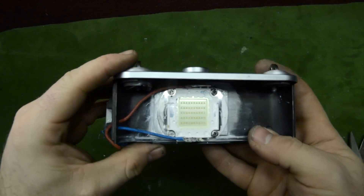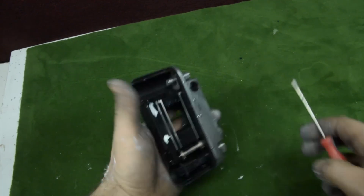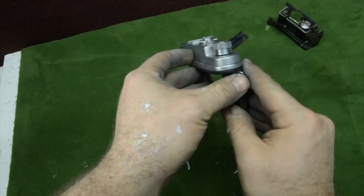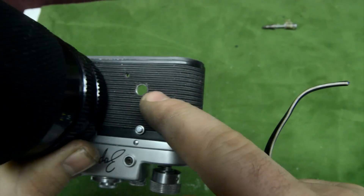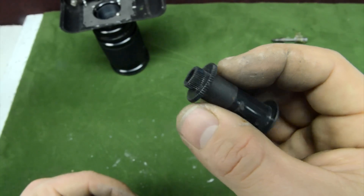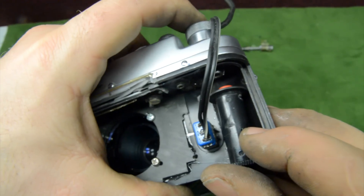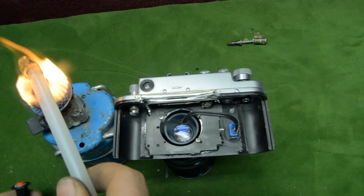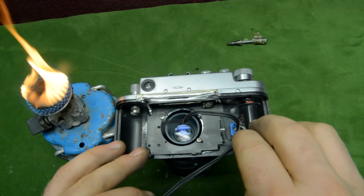As you can see it is very precise work. We can now put the fan in place and keep it on top. We can take apart the remaining parts of the camera — this part will block a lot of light so I suggest you remove it. We can now put a small switch inside the camera and this hole is just perfect to keep it in place. We also take a small button that can go inside the film holder of the camera, and after connecting two wires we can glue it in place under the push button for triggering. Every time I push the button I activate it. Let's put some hot glue inside the camera body to glue the button in place so it doesn't move.